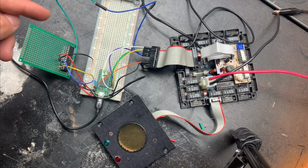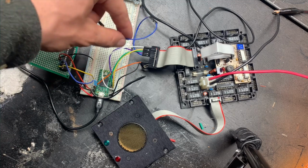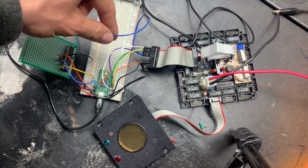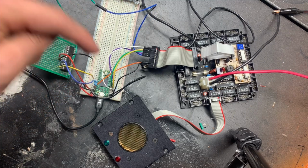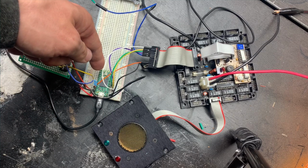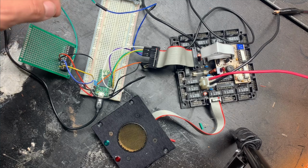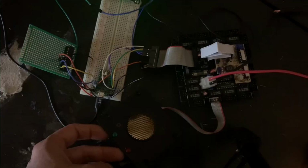But mainly during my testing, I found that this pulse signal kind of sinks a ton of current, more than I was expecting to. I haven't measured exactly how much, but it causes the voltage to drop way low when I'm just trying to run it directly off one of the Arduino's output pins. And so this I/O expander can actually handle a little bit more current throughput, and it doesn't have that problem, so it's able to trigger this just fine.